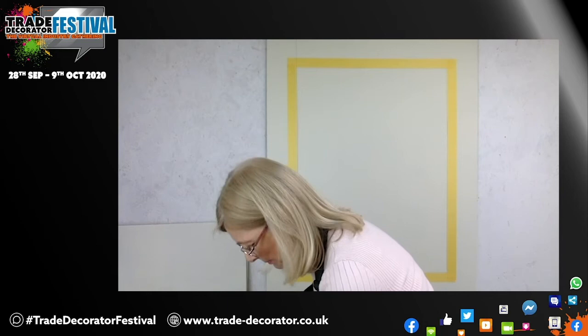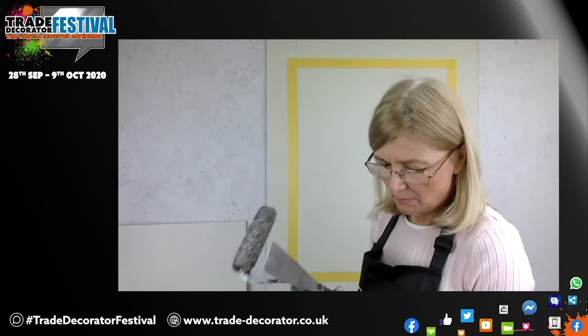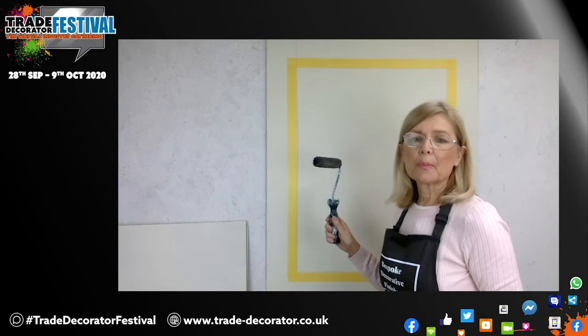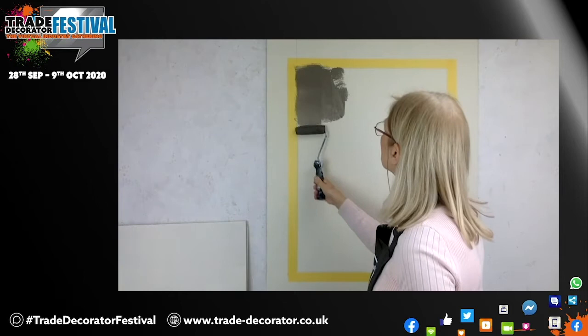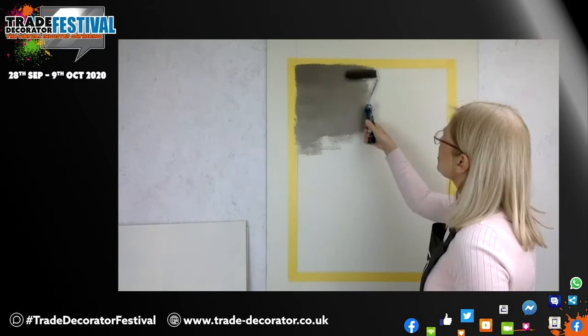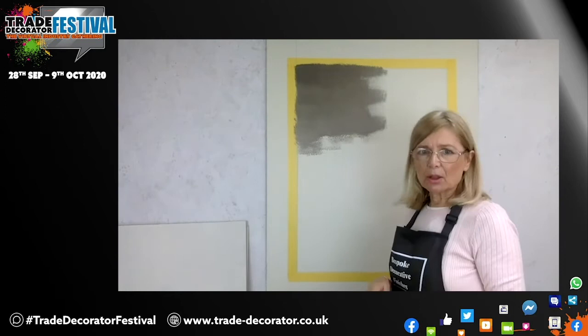This plaster is very much like thick paint — actually it's not thick at all. So you've taped your ceiling line, you've taped the sides of the walls, you've taped your skirting boards. You need to tape because it's not like cutting in, so you just need to protect everything. Then you can just roll it on. Especially the first coat, you're not really bothered too much — you could roll the whole thing.